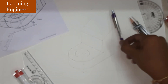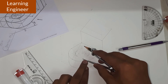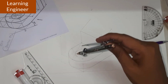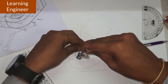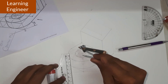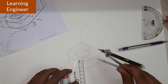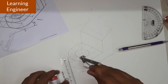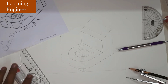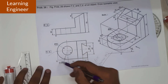This is the radius. Taking this as a radius, join the points. I also have to join these two points. For completing the circle, I have to come 20 mm below from this center. From that particular center, 20 mm below, I join. Because from the top side, this surface is visible. This is how we have completed the rectangular and circular parts.